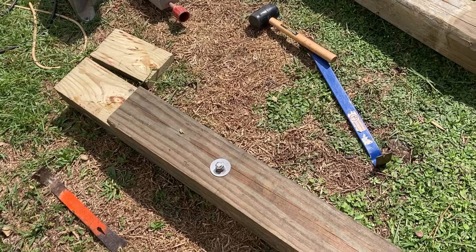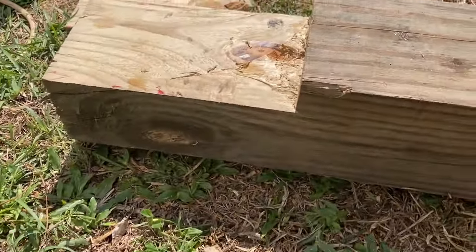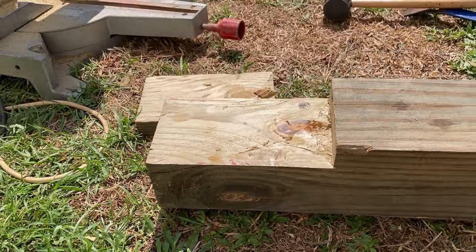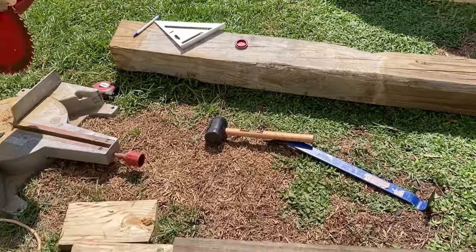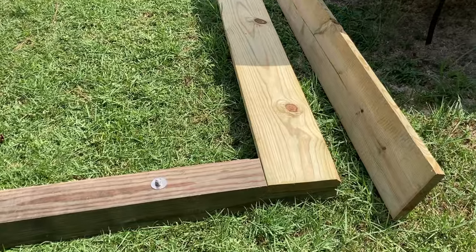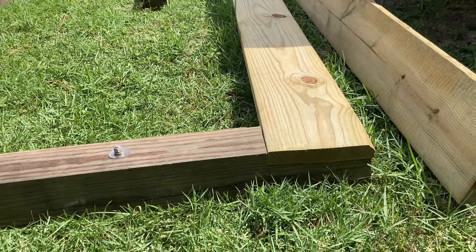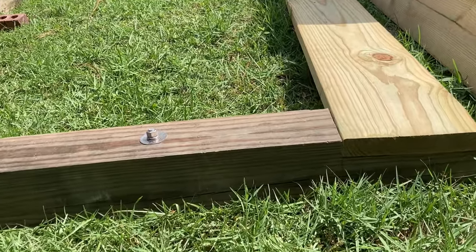I've just dry-fitted some of the 6x6s, trying to get a feel for the distance between them — the run, which is going to be just at 10 feet. I ripped this 6x6 in half and I'm notching where the 2x10 joist is going to sit on top of it. This way I'm not bolting it into the side of the post — it's actually going to be sitting on a ledge for sturdier support. That's the special sauce: the 6x6 notched out to fit the 2x10x20, making a perfect ledge that distributes the weight really nicely.